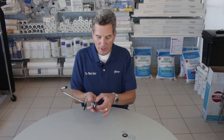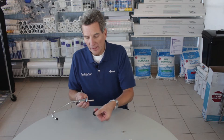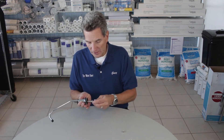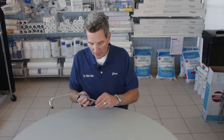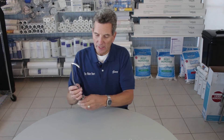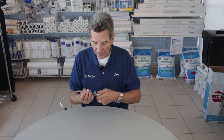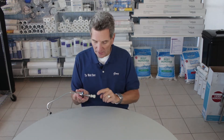Once you've drilled the hole and selected the faucet location, you put the faucet in. The trim ring and the large black washer go on top. From underneath, you put the large flat washer, the rubber washer, and the star locking washer on hand, then tighten up the nut from underneath. Make sure it's straight and tightened up. Then this fitting at the bottom connects the tubing — it's a quick connect fitting. If you're not familiar with quick connect fittings, check out the linked video.